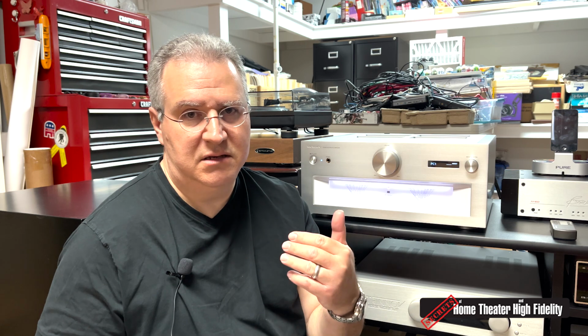They're actually analog amplifiers. They just use high-speed switching devices for the gain stages as opposed to linear gain stages that are traditionally found in Class A and AB amplifier designs. This makes Class D amplifiers lighter and more efficient because there are less losses to heat than traditional designs. That being said, the amplifier tech in the SU-R1000 is not Class D. It is not analog. It is digital.